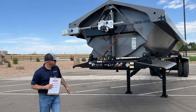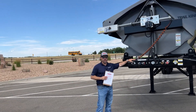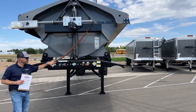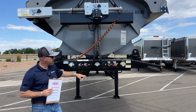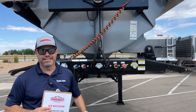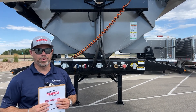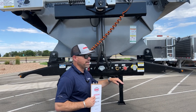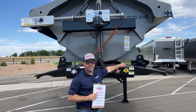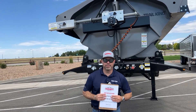Starting at the front, you have a two-way plug for your tarp — this particular one is a horizontal plug. You have your glad hands, pretty standard stuff, and then your pressure and return for the hydraulic lines. You will need a two-way or two-line wet kit on your truck to operate this trailer. Over here you have a plug for your remote control, so you can operate the trailer from outside or inside the cab.